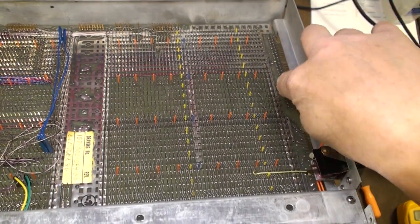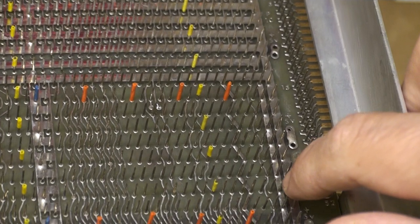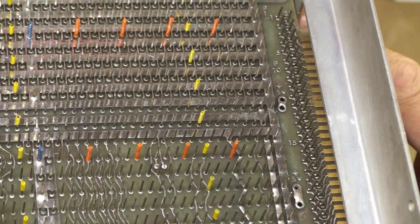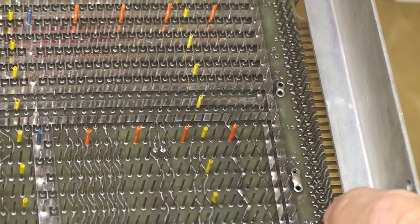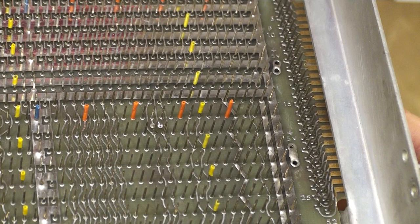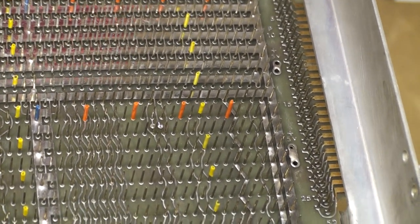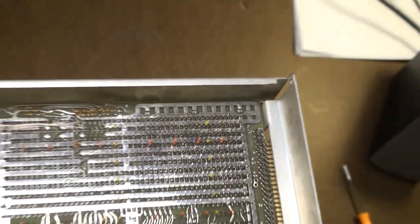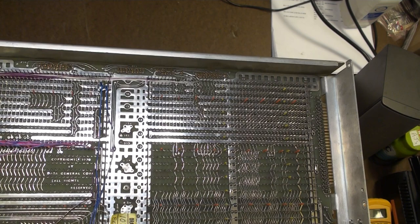I was talking about the upper control panel connector - these are just the pins, and on both sides you can see that the card edge connector just goes right to the pins. I think the top goes to the back row and the bottom goes to the front row - top meaning the side we're looking at right now as it faces you. One of the things I'm going to want to be figuring out is where all the voltages are, and we'll get to that in a minute.